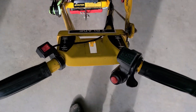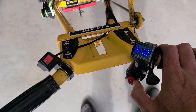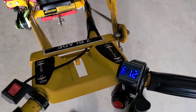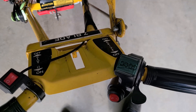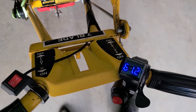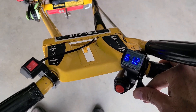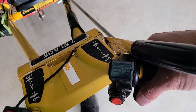It takes about 20 minutes to mow my lawn and that only uses about half the battery. Over here on the steering wheel control, this turns it on — you can see it's about 60 volts. It looks like it's appearing and disappearing on the video recording but that's just an artifact; it's definitely a solid 61.2 volts. There's still a typical drive shaft, so as you spin it up, the voltage drops a little bit.